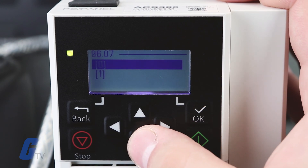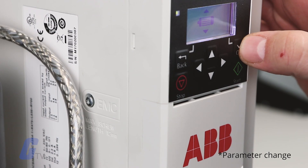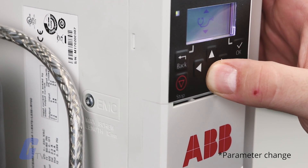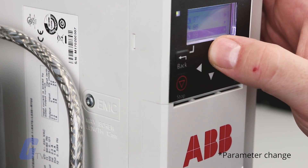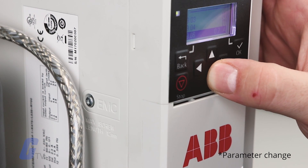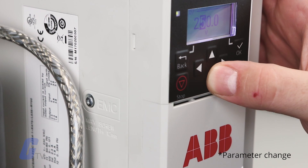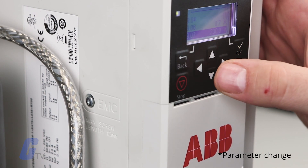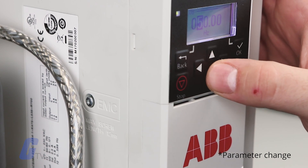The panel also has room for one automatic backup. These backups are created two hours after the most recent parameter change. After completing the backup, the panel will wait 24 hours before checking to see if there have been additional parameter changes. If there are, it will create a new backup that overwrites the previous backup after two hours have passed after the most recent change.